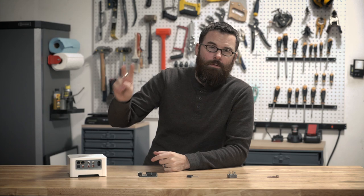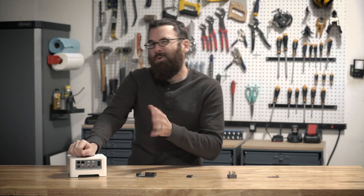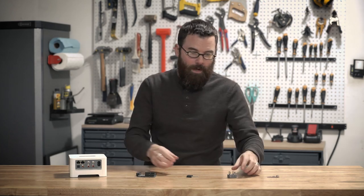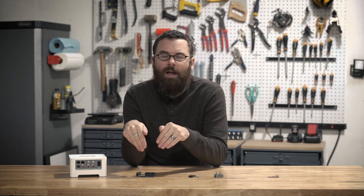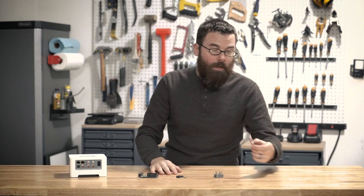On the back of the Sonos there are a couple of different outputs: two digital outputs — a coax and an optical — and then the analog outputs. The analog outputs are AC, so they won't feed directly into an Arduino. I tried playing around with the digital outputs but they were more complicated — I'd need some kind of receiver chip or circuit and a lot of logic. So I stuck to the analog side. I used bridge rectifiers to rectify the AC into a DC signal, put that into the Arduino, used smoothing capacitors, DC bias circuits, and smoothing in software, but I just couldn't get it to reliably detect quiet songs above the noise threshold.